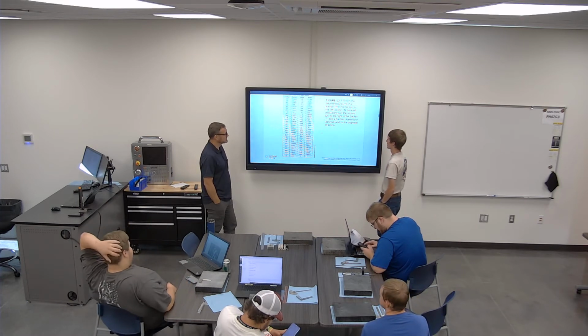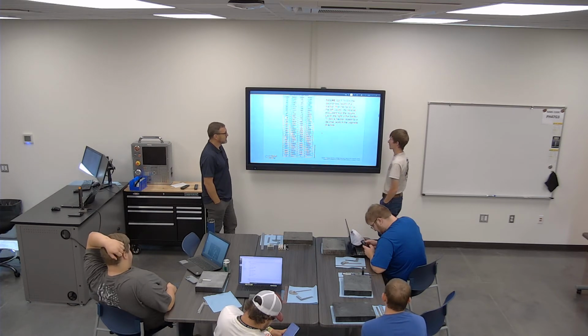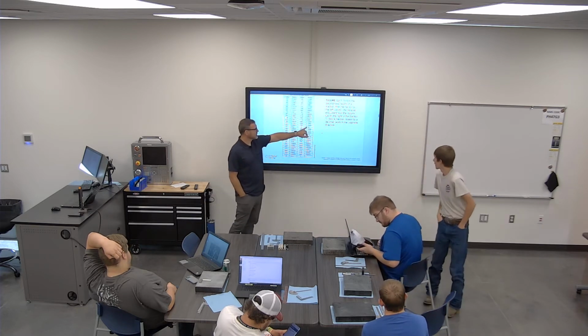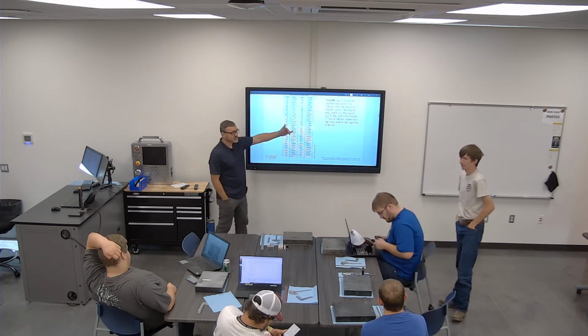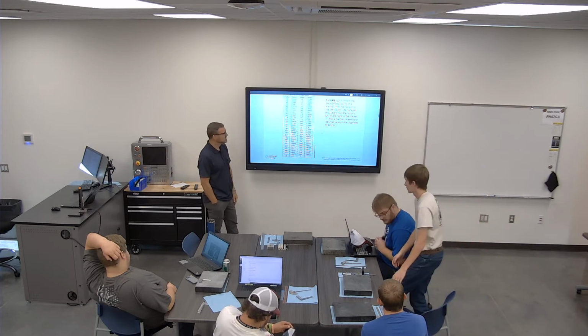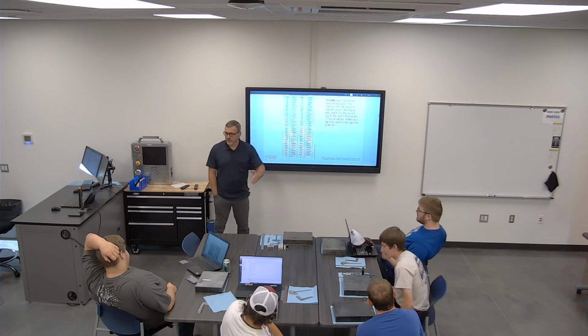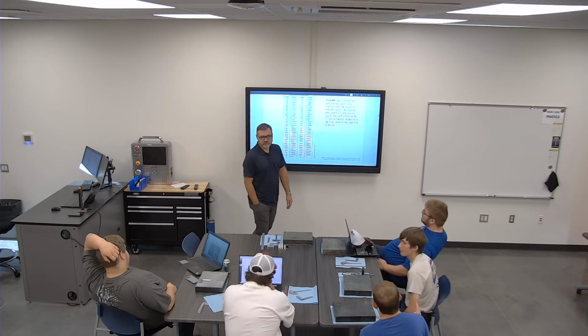47/64. 734 thousandths. 734 thousandths would be fine. Yeah. So you could round it up, 734.4. 734 and 4/10 would be appropriate. But 734 would be all that I'm looking at for this class. Okay, so just three place decimals is all I care about. 734. Just three places out. Okay.